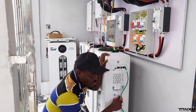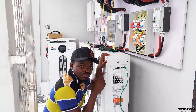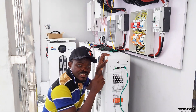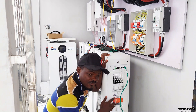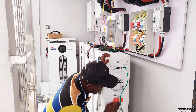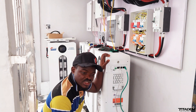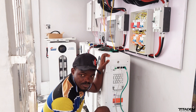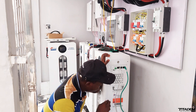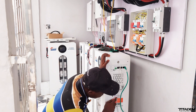If the battery is not charged to 58.4, it doesn't matter — even if you've connected the communication cable, you still need to make sure that the system can charge the battery to 58.4. The next parameter is float charging: 56.0 to 56.8. That's just where it stays after it's fully charged. That one does not really matter. The one that really matters is the first one, which is the full charge voltage.